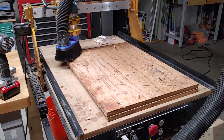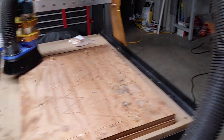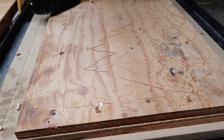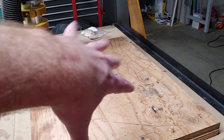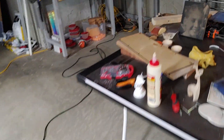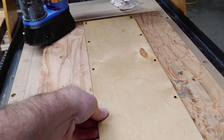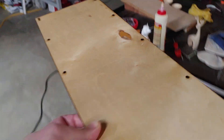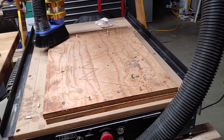This is my home machine — it's fun. I have one I built in my garage that's much larger. For this project, I just machined holes for these dowels. I'm going to put a piece of maple on here, cut four trivets, flip it over, and machine the other side. What I've done is created a laser drill jig. This drill jig fits on the dowels — I'll lay it on my maple, drill out all the holes, and then pop the maple on and machine it.